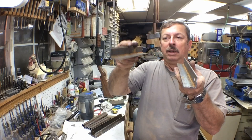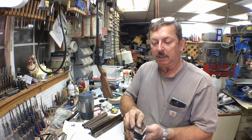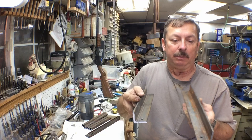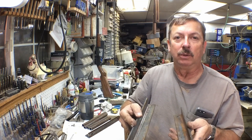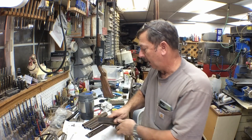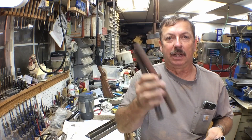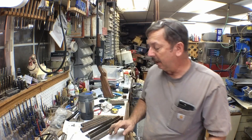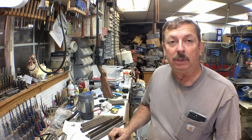I've already drilled everything. The upper case support doesn't need to be drilled because all it's doing is supporting the edge of the top of the case. The bottom has two half-inch holes drilled in it, 10 inches apart - the actual dimension on the case is about 10 and an eighth inches. The centerline of the hole is a half inch off the base of the angle iron from the inside. That will line up the two mounting holes for the bottom of the case if you want to bolt them in place. The bottom pieces are out of heavier material - I drilled four quarter-inch holes in each one in case you want to bolt it down to a bench top. For the uprights, we've got four pieces of half-inch pipe - the longer pieces are nine and three-quarters and the shorter ones are seven and three-quarters.